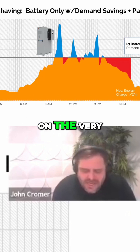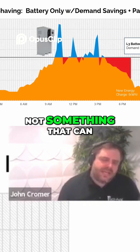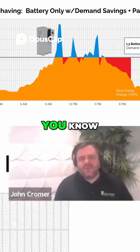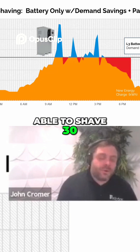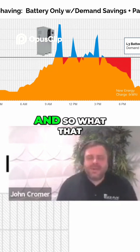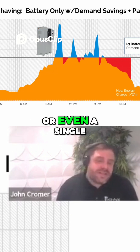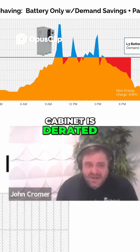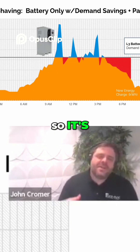You're literally just working on the very tip of the electricity — you're not worried about base load. This is not something that can take care of all of the electric bill like solar has in the past. If you look at a peak demand charge of 100 kilowatts, you might only be able to shave 30 kilowatts off of that 100 kilowatt demand charge effectively. A single inverter, or even a single inverter with a single battery cabinet even if the battery cabinet is derated, can be the most cost-effective system.